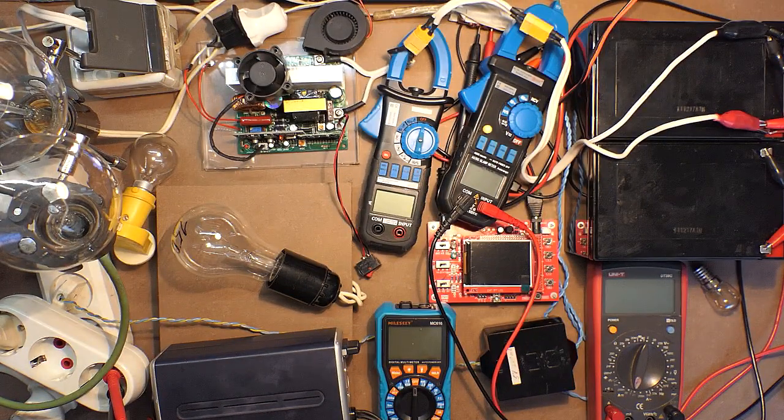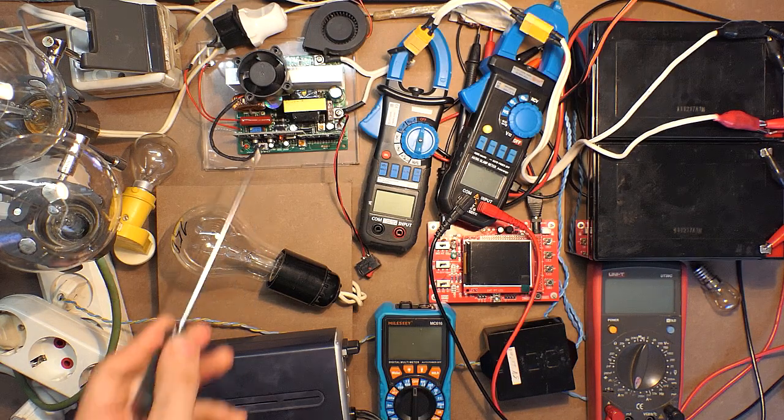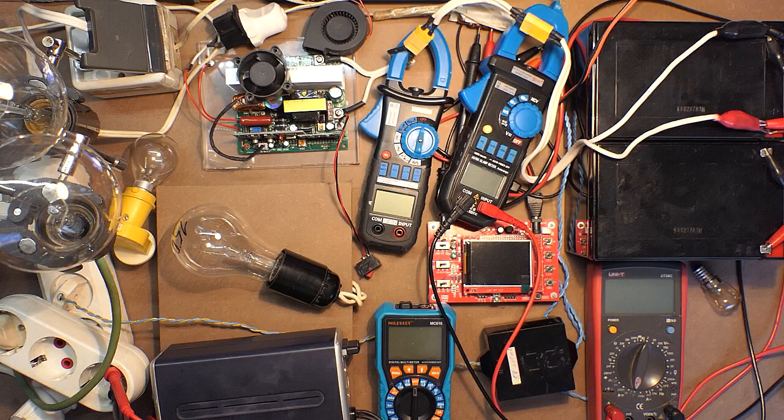And now about the conclusions regarding this device. As to the advantages. The device has tiny dimensions, it isn't heavy at all, it can be placed in a small plastic box, it has its own cooling management system, and even in case of problems with the fan, the device will not provide any power if the board is considerably hot. As to the disadvantage, the only disadvantage I have found in connection with this device is that the information provided by seller differs from the reality.